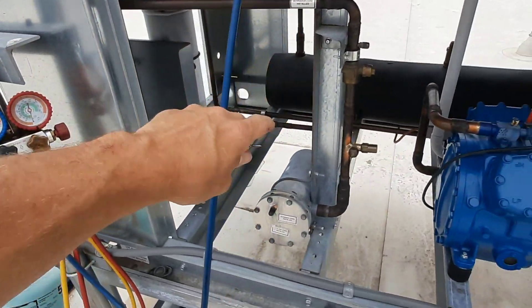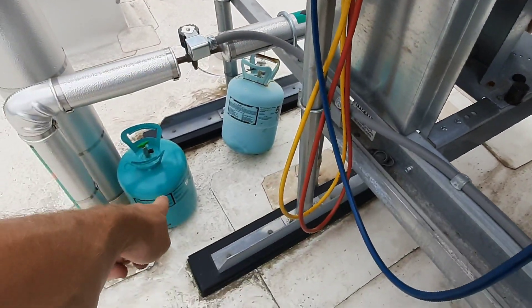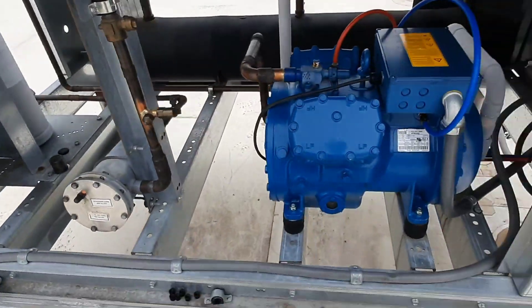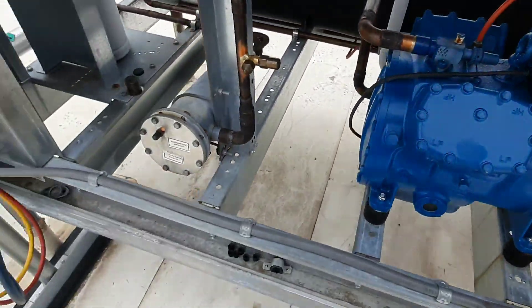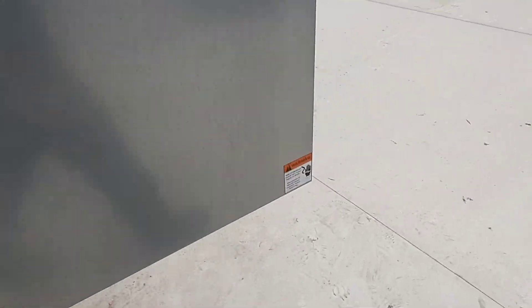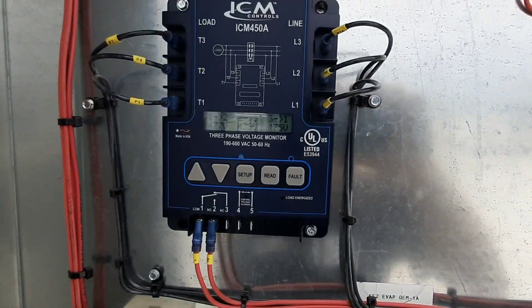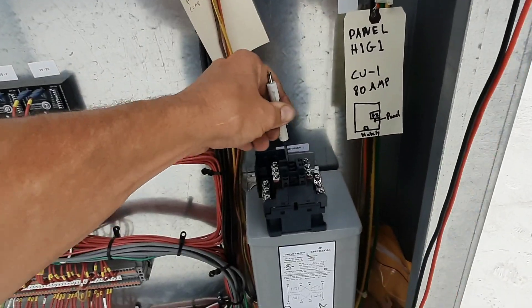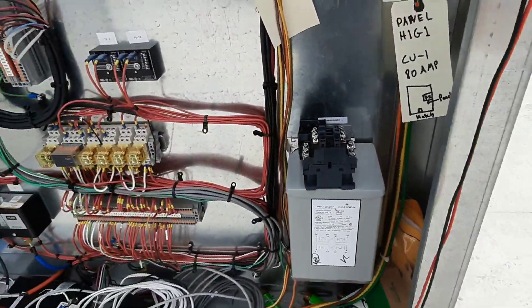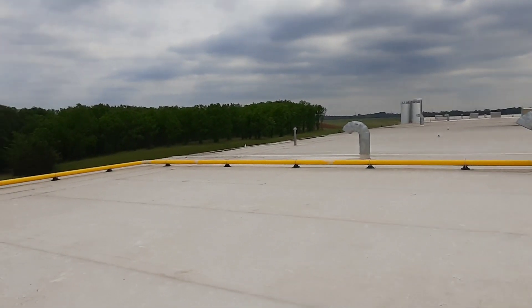I need to get probes and everything else up here to make sure everything's correct. I just hooked my gauges up — this is R-507, so I need to check the saturation temps. Nonetheless, this looks pretty good; all seems okay. We're going to get refrigerant charged in and go from there. Phase monitor's good, contactor's good. I'm going to hang onto the old contactor — it'll be good for demonstration purposes. Anyway, that was a quick one; I'll get this finished up and see y'all next time.